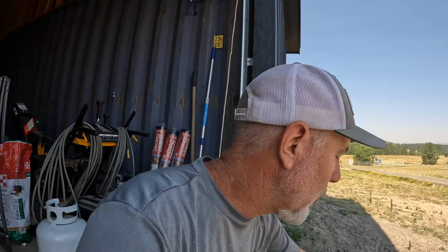I'm probably gonna make some sort of a T-tool that I could stick down in there and turn the valves off. But other than that, this is basically a permanent connection that I wanna make sure is not gonna leak. And then of course we have PVC primer and PVC glue that we're gonna use for all the slip fittings. So we have some 2-inch PVC. We're just gonna go ahead and start with one tank and then just work our way all the way down